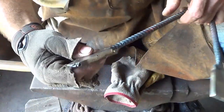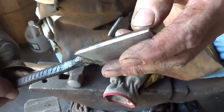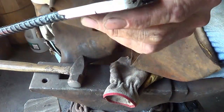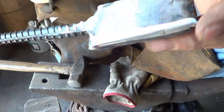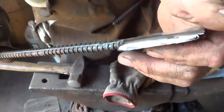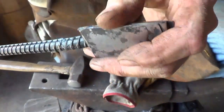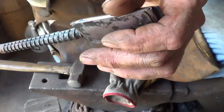A couple of things. First of all, this is the sand-fluxed one — looks good, it ground well. I see a couple of things in there that raise concern, but whether or not we can work that out I'm not sure. This was the no-flux-at-all weld, and you can see we've got lots of concerns there — I went pretty deep with the grinding. A lot of this kind of stuff going on on the outer layers. Oddly, there was something on the outside of this steel — it must have been carbon. Hit it with the grinder and a black powder started coming off, looked like smoke at first. Ground much harder to get that stuff off. So there's something more to the story I didn't expect. That's what they look like ground up — let's go ahead and etch them, see what the pattern looks like.